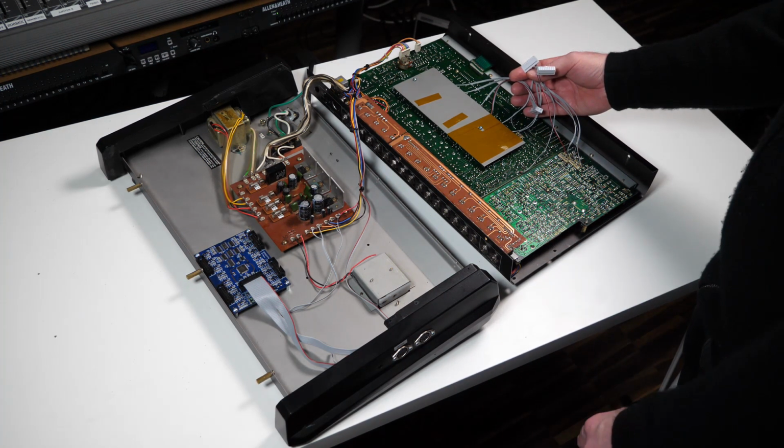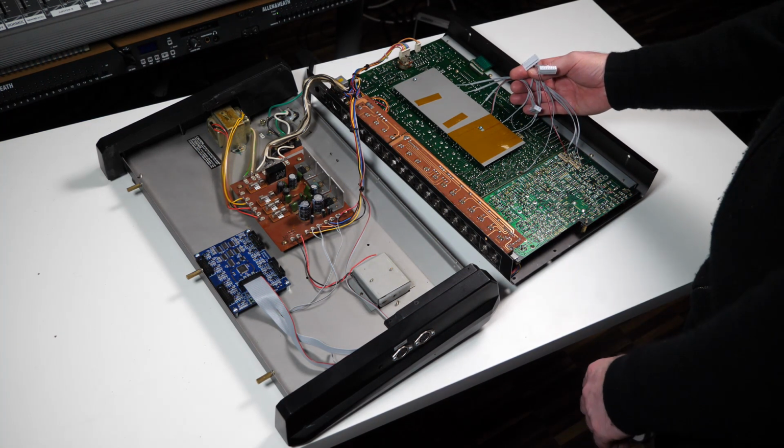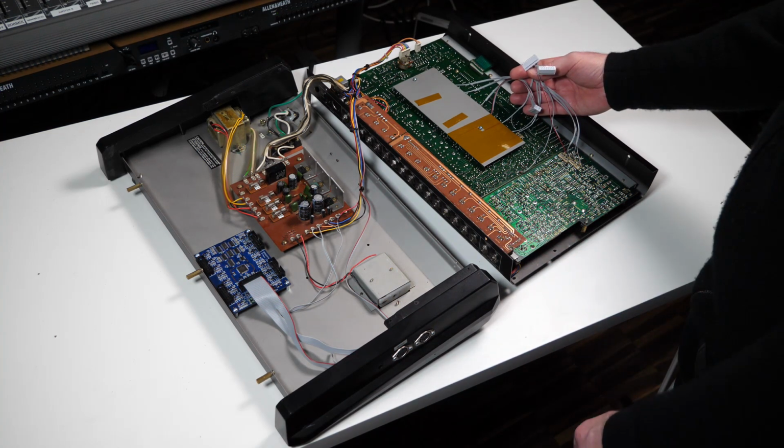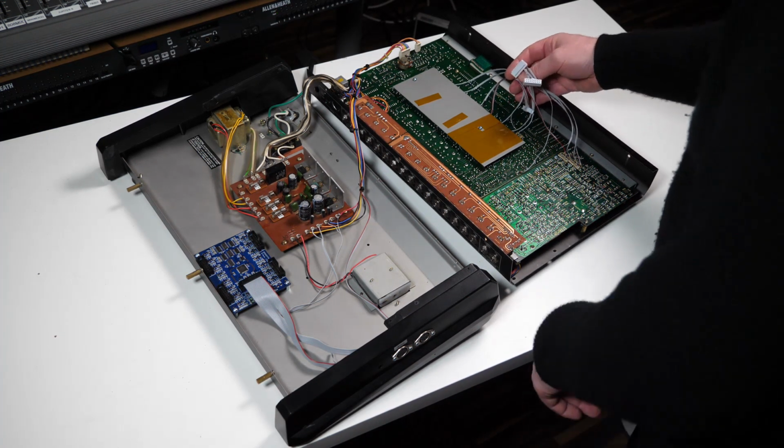The clap and the maraca are on a switch on the front panel of the 808, but they are two separate sound circuits, and the switch is just there because of the limitations of the processor. So the maraca is available as a separate sound to the clap. It can be triggered at the same time or independently.